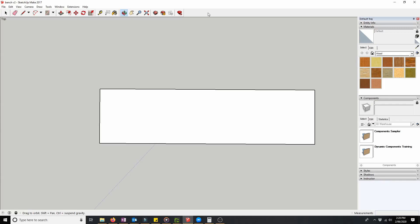I've designed this bench around the top from our local hardware store. They sell a piece of plywood which is 30mm thick, which I believe is going to be thick enough for what I require. It's got a length of 2250mm and a width of 600mm, which is a nice size for the area I'm going to put the bench.